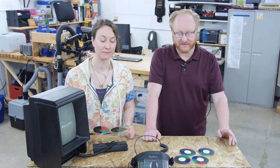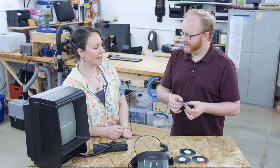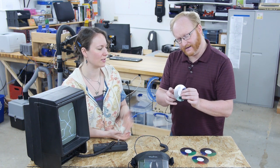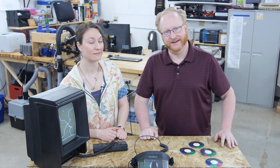That's all we have for today. It was pretty fun reproducing these hard-to-find discs. We had to try a bunch of different methods, but the simplest ended up being the correct answer. Luckily we had those film gels left over from last fall — we could cut them with the laser, 3D print the housing, and boom, we have a disc. We tried melting the edges, but the soldering iron didn't work well, a lighter was okay but sometimes warped it. Just sandwiching them between clear plastic works fine. We do all the gluing in the center and keep the glue to a minimum. I made three copies of the missing disc and also a copy of the normal disc just to have a spare. What were some of your favorite video game consoles from the early 80s? Tell us about it on the Element 14 community at element14.com/tbhs. You can also go there to read about upcoming episodes, builds, and special events. We'll see you next time.